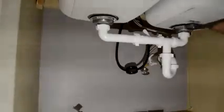Notice that I have that pipe in a particular way, facing up, the one that is going to connect the dishwasher. That's really important. And once you're ready, you know that everything is in place, you want to go ahead and put the Teflon, touching that washer that is going to go inside. The washer is always going to have the thinner part towards the next piece, and then go ahead and use your hand to tie this really well.